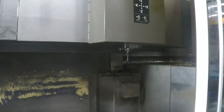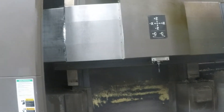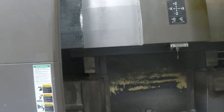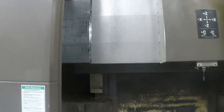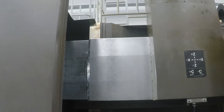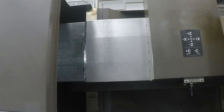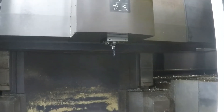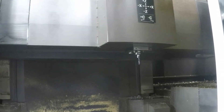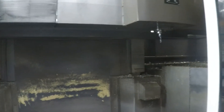Here we go moving to the centre. It unclamps, and you can just see it moving. You might just detect on the video that the crossrail is now moving vertically to give you more height. Then the X-axis goes back to its previous position. So in that cycle you have the balancing position built in.